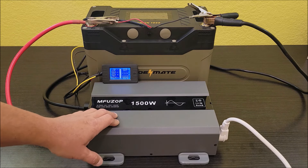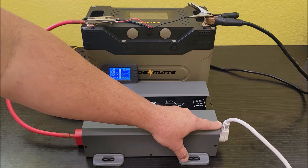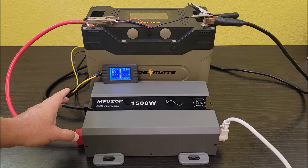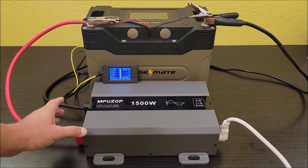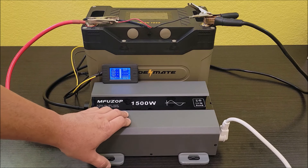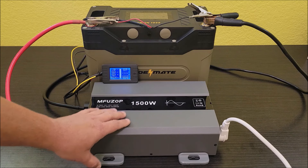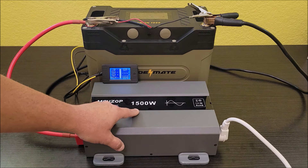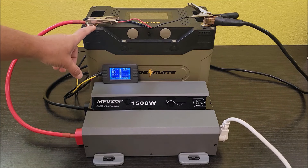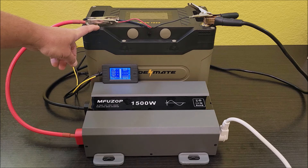I have it hooked up to this 1500 watt pure sine wave inverter, which is connected to a 5,000 BTU portable air conditioner. The only reason I have this is to put a real-world load on the battery. This air conditioner will start the compressor and can go beyond 1500 watts — usually a couple kilowatts to start — but this inverter has a peak rate of 3000 watts and a max running rate of 1500 watts, which is well over what the air conditioner needs. We're going to put that load against this battery and see how many watt hours we can get out of it to confirm we're getting the power storage we're purchasing.